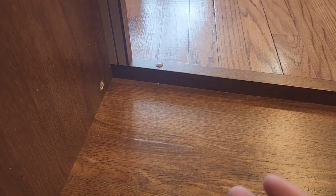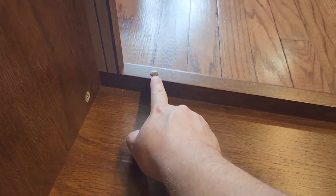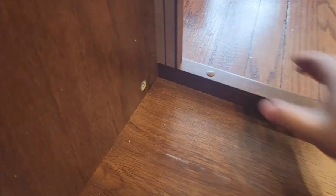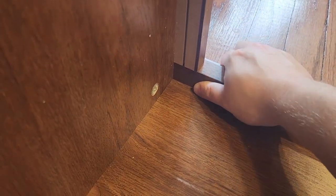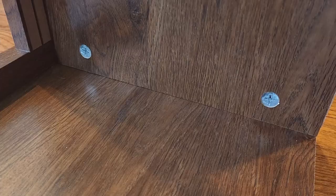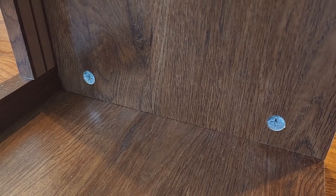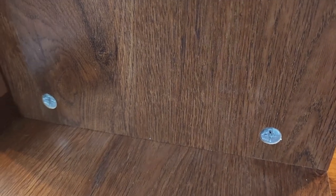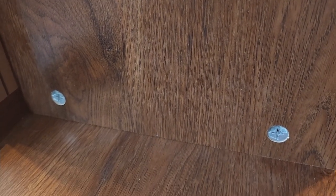Little bit of a change of plans — we're learning as we go. Those plugs are incredibly difficult to take out without scratching the surface. I was able to get it to fit by grabbing here and pushing harder downward on the molding to get those to drop in, and I already tightened the cams on this side. Be very careful standing up like this because a slight push could break it pretty easily. Knowing what I know now, I wouldn't put those caps in just yet because that made things more difficult. When tightening the cams, it's about a three-quarter turn — you'll feel when it stops. Make sure you go almost a full circle so they're locked in completely.